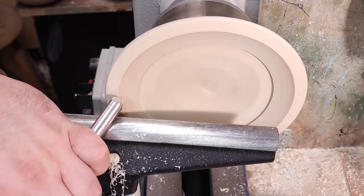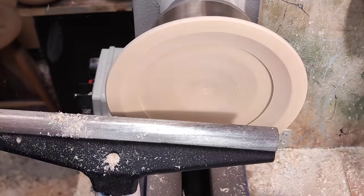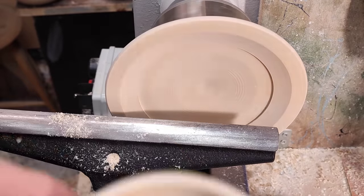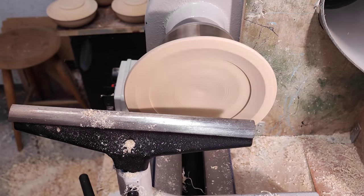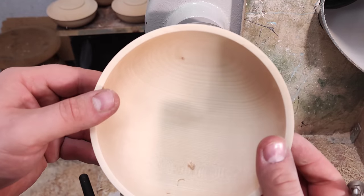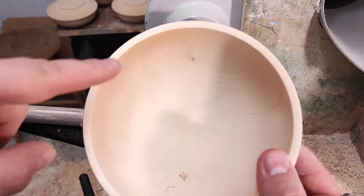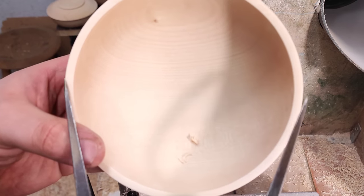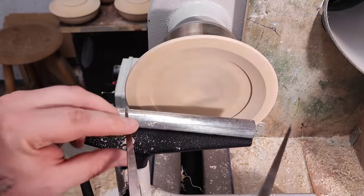First things first is just to true up the rim here. I want to take the measurement of the last bowl — I sort of make these specific for each bowl, but if they get mixed up we just find a match. I take the measurement from the long side because when this warps, and it usually does, it goes through the long grain and goes oval. So I'm taking this measurement along the grain — that's the right measurement.